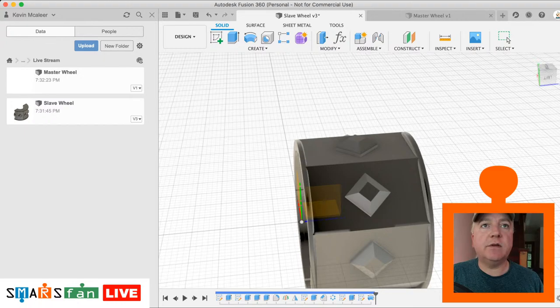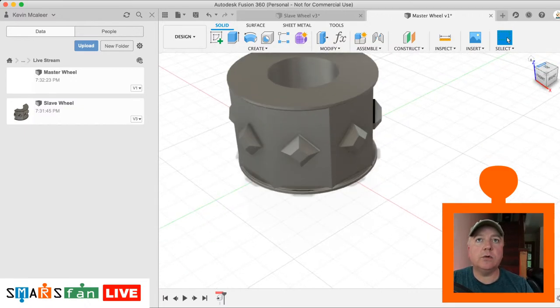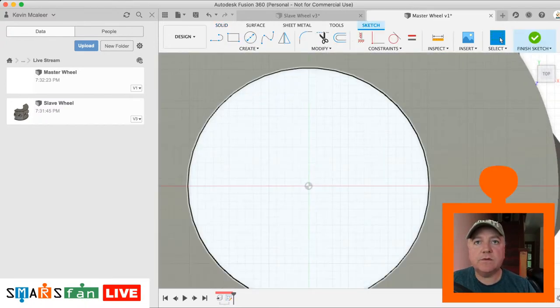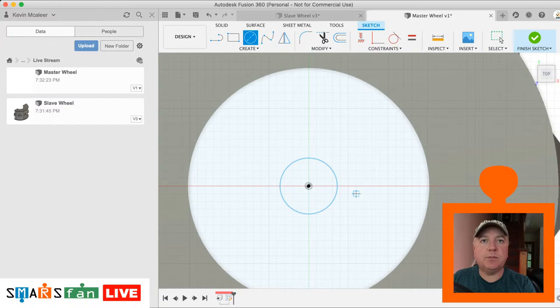So what this is looking for, this derive window that you can't see, that's frustrating. There's a window that's saying derive, and it's just asking me which objects I want to select, and I'm just going in there and selecting the body. So I'm just going to click OK on that. So now I've got a derived body. And what I want to do is basically just fill in that hole on the back. So if we just create a sketch on there, and the sketch is very simple, so it's just going to be a circle. So the diameter of one of the motors, that motor spindle, is exactly 3 millimeters. So if we do our dimension that as being 3 millimeters.